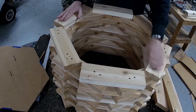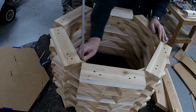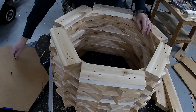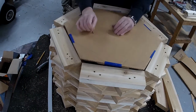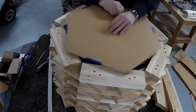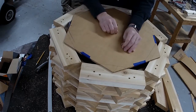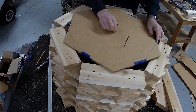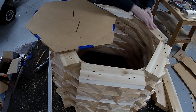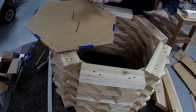That's what we ended up with. It went really well and pretty quick. I put a straight edge in here and they all line up remarkably well — I can hardly see a variation between them, maybe an eighth of an inch at the most. A couple of things I learned: when I pull the index out, there's always one spot where it seats in really well. The cardboard pattern held up through the whole process. I also pre-drilled because I didn't want to risk splitting the cedar. A few places, especially at the top, I put in double screws for strength and torsional rigidity.